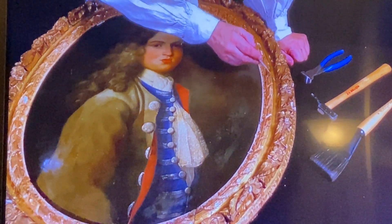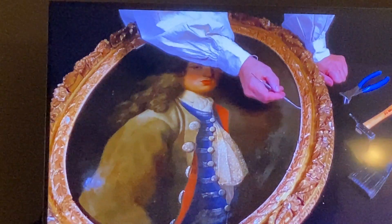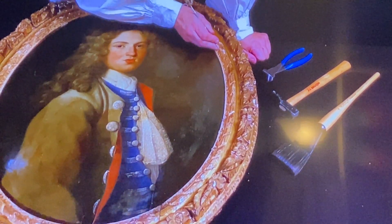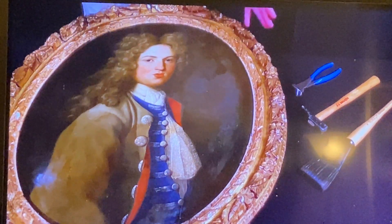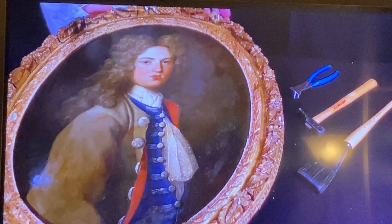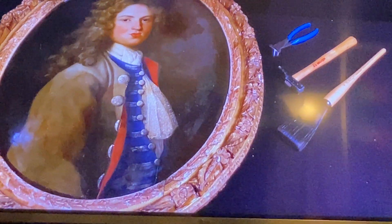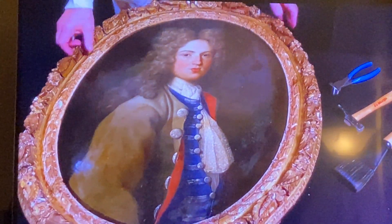We have some original gilding in this gutter coming around. What we're seeing in red is a bit of bole from cleaning. You can see a little bit of gesso, the white, peeking through in various places. Right here we're down to gesso — the base gesso still has a really good bite. When we re-gesso this, we're going to keep as much of the original gesso as possible. When you put gesso on a restoration area, you can't fill up all the wonderful original carving spaces without having to re-cut them. In French it's called recutting — we re-cut the gesso to bring back the detail that was first put in by the wood.